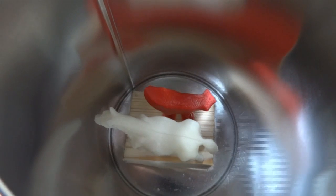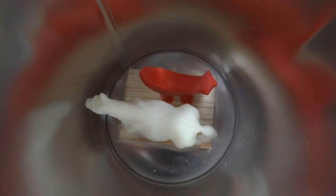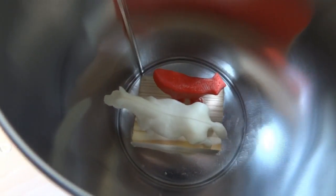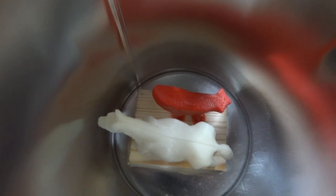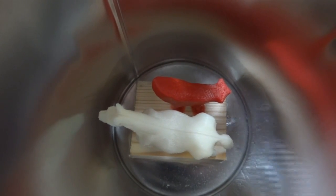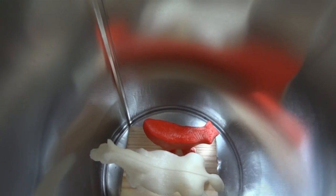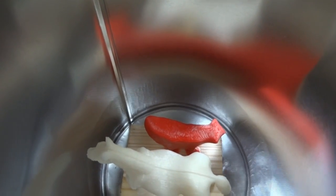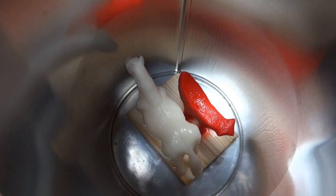Things are getting more shiny, and the highlights on certain parts on the layers are getting less detailed. And you can see the acetone boiling in the bottom there. It appears that the hooves of the horse — basically the parts on the wood — are actually kind of wet, so it's probably going to dissolve and they're going to sink a bit. But obviously that's the purpose of dissolving the surface. We can see a distinct edge just north of the red Superluminal banana — that rim around the edge of the container — that's where the acetone vapour cloud is reaching. Parts are looking smooth and shiny.